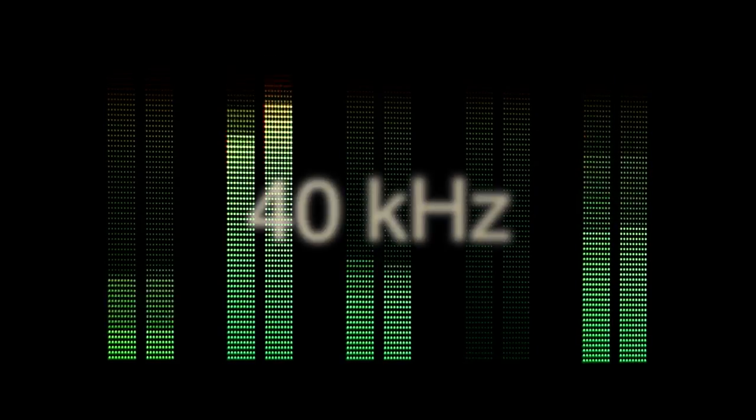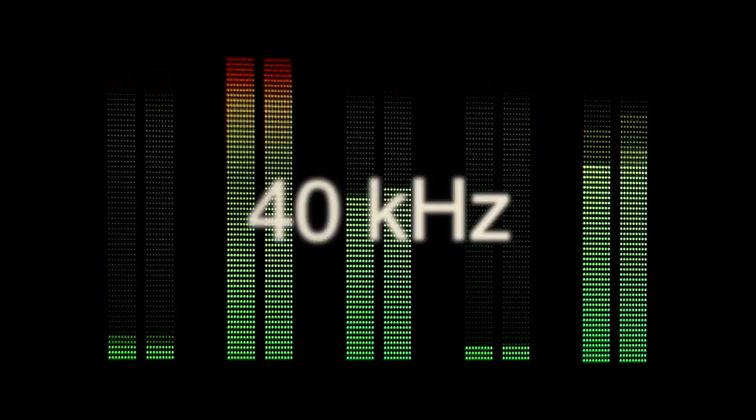Since most piezoelectric transducers operate at 40 kilohertz and above, the first subharmonic frequency is above 20 kilohertz, which is beyond the range a human can hear. Magnetostrictive transducers operate at 30 kilohertz or less, which puts the first subharmonic in the audible range for humans — 20 hertz to 20 kilohertz. The sound is identical to the hum emitted by a high-tension electrical line or transformer.